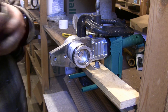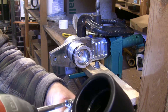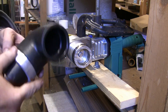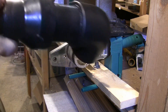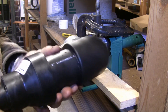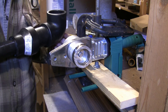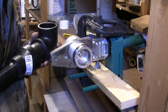All right, that's been our 30 seconds. Let's do a quick inspection of the weld. Remove the cold ring — which isn't cold anymore, what a surprise. And there you can see, right along there, that bead of melted material. I'm pretty happy with that. That is going to hold without any difficulty. So, can you do a do-it-yourself pipe fusion weld using a $59 Amazon machine? Yes. Should you? Probably not.